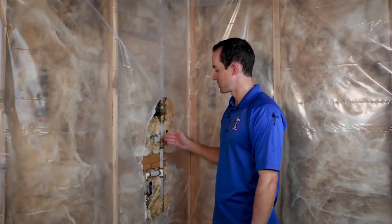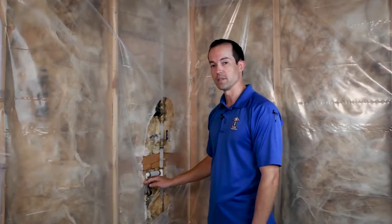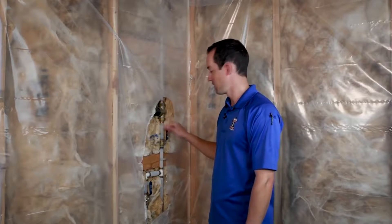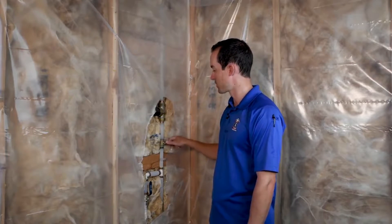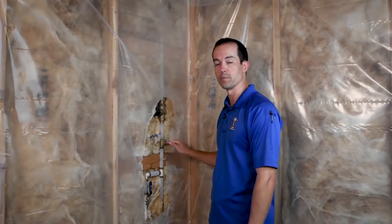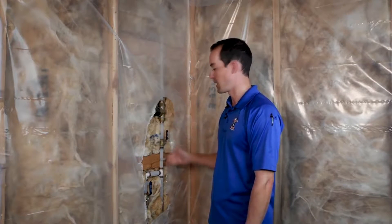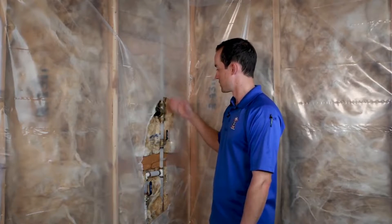But what you're looking at when they put the shutoff valve inside of your basement is this is the main water supply coming in from the meter outside. This is the main house shutoff valve. Any valve that's perpendicular to the water line would be off, and any valve that's parallel to the line would be on. So this is for the house.